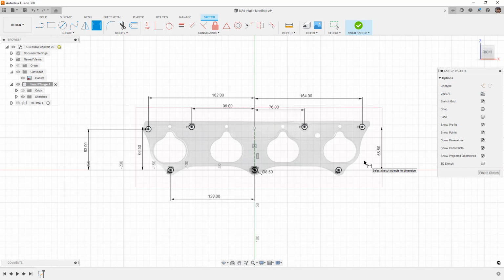The outside of the plate, again, we can keep it simple and we can make it a rectangle. Something like this, you're probably not going to cut by hand. You're probably going to have water jet or laser cut. In reality, these plates are often CNC machined because of the port injection and the opening and the shape of these ports. Oftentimes they're a little bit more intricate.